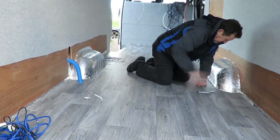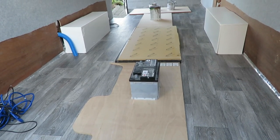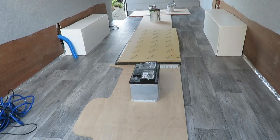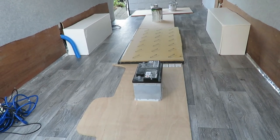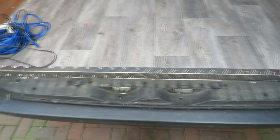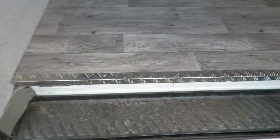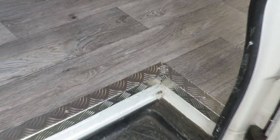I put some weights and boards down just to make sure that the center area, which will be a high traffic area, is well and truly stuck down. Once it was all trimmed I installed some checker plate angle — just drilled and glued and screwed it in — which finished off that edge nicely. So that's it for this episode, thank you very much for watching and I hope to see you in the next one, take care.